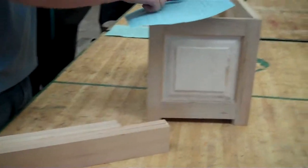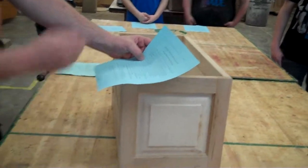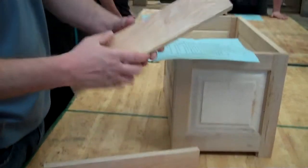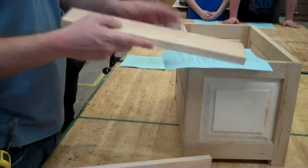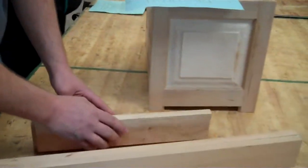I've already done numbers one through six on your blue paper. I just pre-cut these to save some time. It has you cut some boards about 16 inches long, two of them about 26 inches long, jointed the edge, cut them on the table saw to three and one-eighths wide, and planed them on the planer down to three-fourths of an inch thick. All that stuff you guys know how to do, so I just went ahead and pre-cut those to that point.